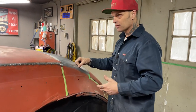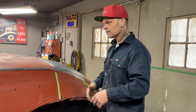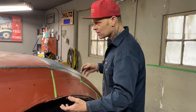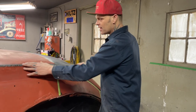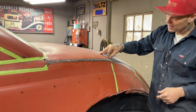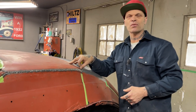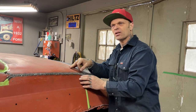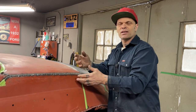So when you think that something looks like poop, well, yes, it does look like poop until you're finished. You know, you have to finish it. I mean, it takes time to finish it. But anyways, as I welded that up, if you can remember, I would not want to weld this piece here. I've done it too many times to know not to do that. I've welded one piece and have a gap, and then weld the other piece, and then you grind it off, then you got a hole in the center. It does not look that good.